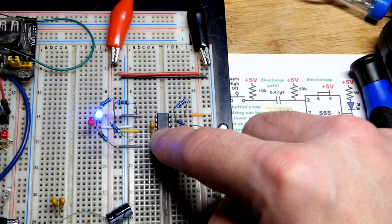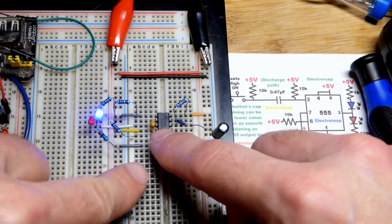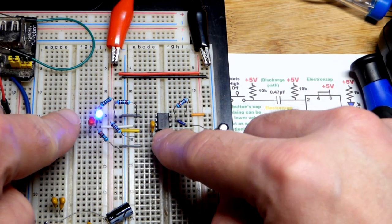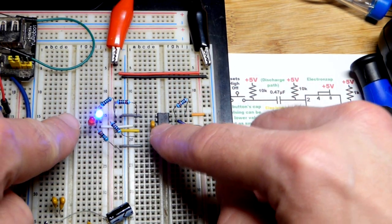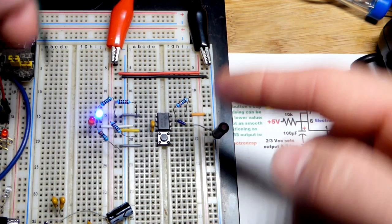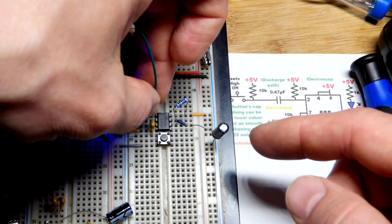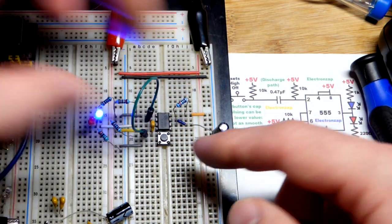The main thing is, if I press the button and hold it, the output's not going to stay high. And this is switch bounce — when I release it, we saw it bounce like two or three times. There are a lot of times there's switch bounce. So that's why you have the longer period of time; that gets rid of those switch bounce problems, especially when you just pressed it.